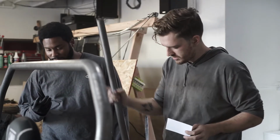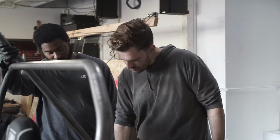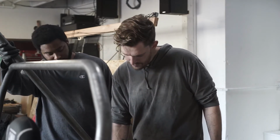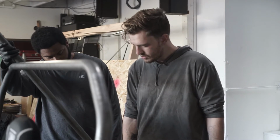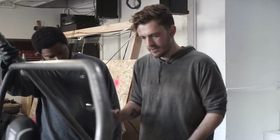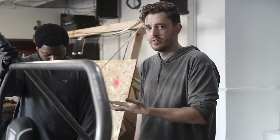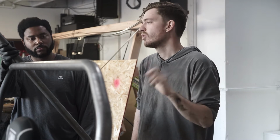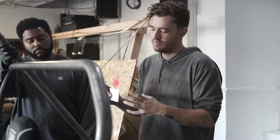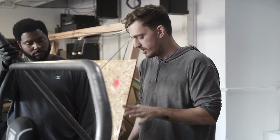We're gonna put in the drop bar. The drop bars basically make the main hoop actually work. So we're gonna go from here to this base plate right here. Typically, the way SCCA and NASA and all of them say, the pad, where the cage mounts to the chassis, I'm thinking of NASA's rules right now, has to be a minimum of 9 square inches, a maximum of 100, no less than 2 inches on one side and no more than 12 inches on one side. So basically it's like a 3x3 to 10 by 10, something like that. But it doesn't have to be a square anyway.